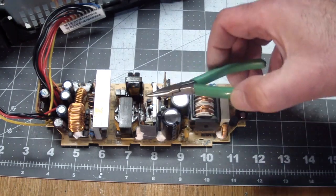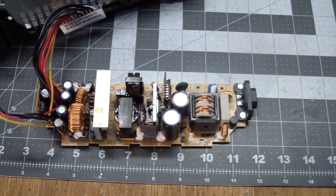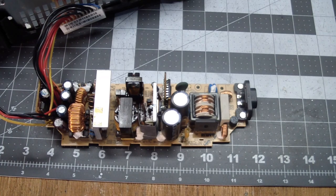And it's a switching power supply. We can hunt, we can check, we can do a whole bunch of stuff here, but in a previous video, actually a few years ago, I fixed the switching power supply in a small Sony color TV. And it was a very non-gratifying job, because every time I found a bad component and replaced it, I would start up the TV and something else would blow in it. And I did that for 3 or 4 times. And finally, I found a Zener diode that had opened up.